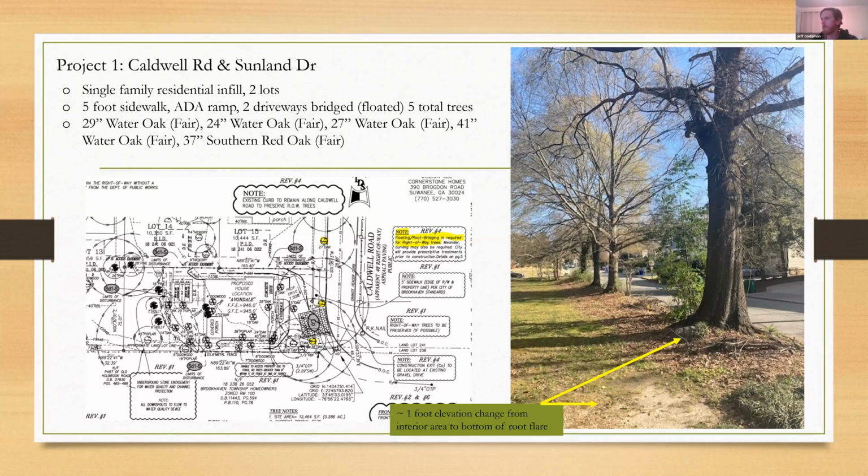And of course, we know the ideal is that the tree protection area is the tree protection area, and nothing happens in there, including operating heavy equipment. So this was one where realistically, there was not going to be sufficient. There wasn't going to be tree fence. We weren't going to be able to have it installed around all the structural root plate, and even most of the critical root zone, which is shown by the larger circles here. We were just going to have to thread the needle and communicate with the builders a lot and do multiple rounds of on-site supervision for different phases of construction.